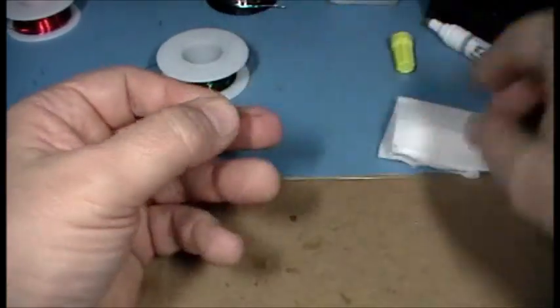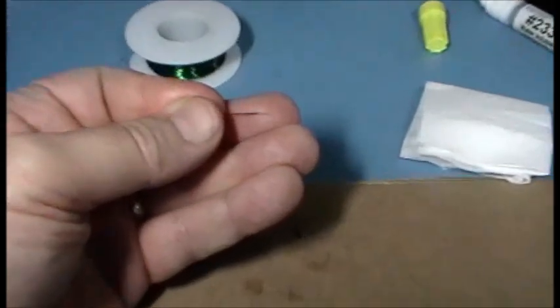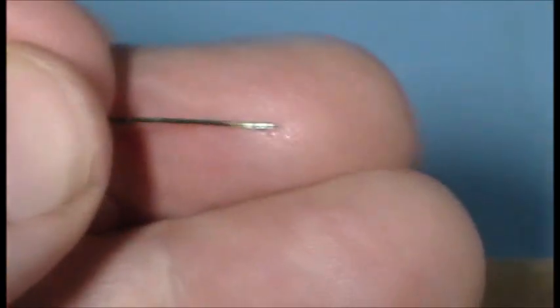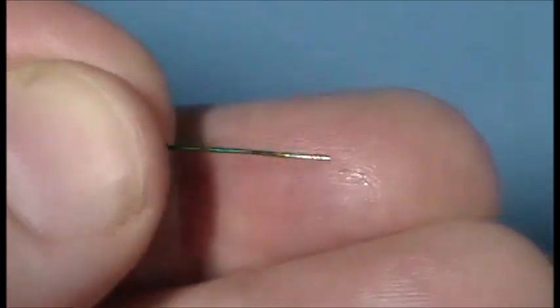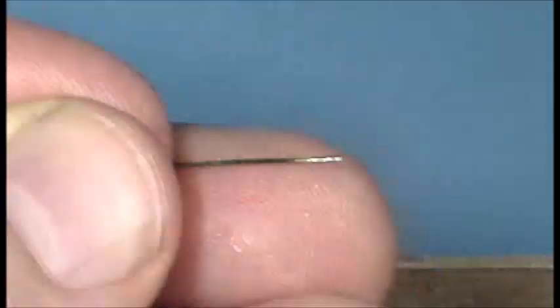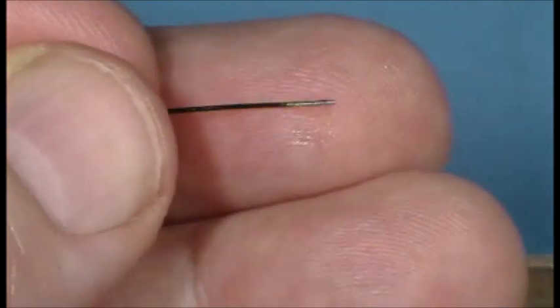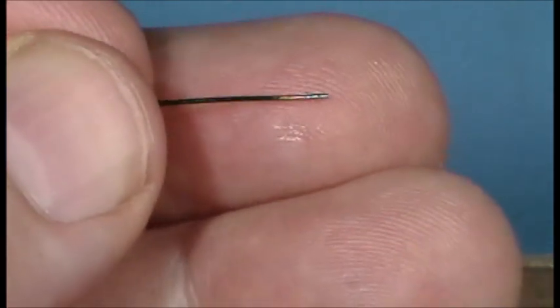Once you're holding them together, you're using two fingers to hold the solder steady, your index finger and thumb to hold the wire, and then all you're doing is touching them together, getting your iron on there very quickly touching both the wire and solder at the same time, and then you're done. Wipe the wire off. You can see how the wire is completely tinned — nice and shiny. Whenever you go to attach it to an LED, resistor, capacitor, or whatever circuitry, you'll have really good results soldering it.